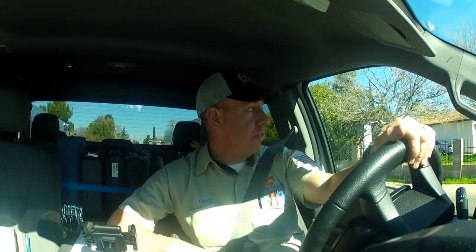It won't start up at all. On startup, the compressor is running at 13 amps, and it's rated for a maximum of 19.3. For a 15-year-old system, and it's like 60 degrees out today, so there's basically no load on that compressor — running around 13.4, 13.5 on a 19 RLA.